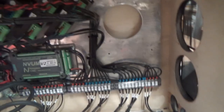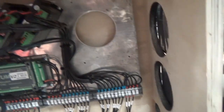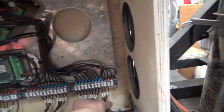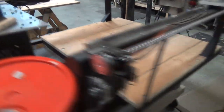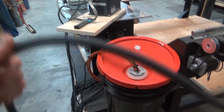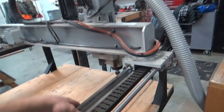Just too noisy. So anyways, I'm just gonna end up, once I get one, putting the drives for the fourth axis right here and voiding that off, and just running our three control wires for our spindle out to this guy, which I'm not sure what I'm gonna do yet. I'll probably make an enclosure with a little bit of expansion room. That'll go somewhere else over here. Not really sure yet. Also had to remove my shielded cable as far as I could. That also seemed to help, and I'm getting some pretty good stability on that now.